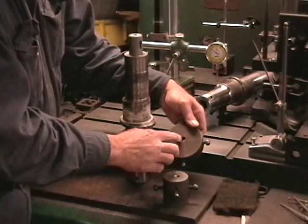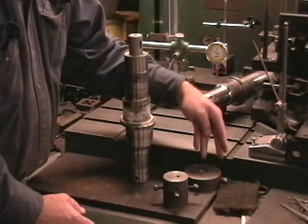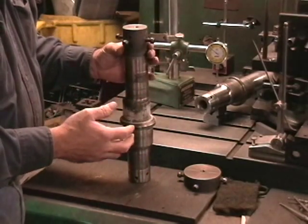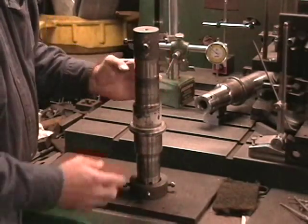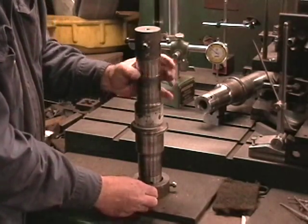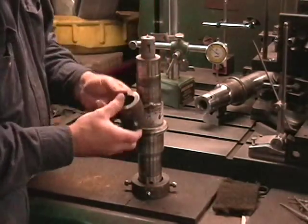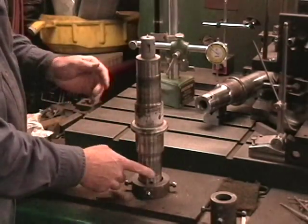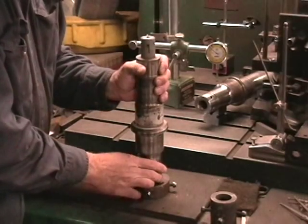This is offset an eighth of an inch, which splits the difference between one hundred and fifty thousandths and one hundred thousandths. And then for the other diameter there's another one. They're set up like that, then indexed and marked. There's the Y offset with those screws scribed there, machined on its sister part. So how do we set these up so we know where the X's and Y's are supposed to be?